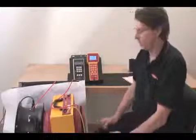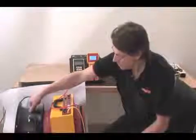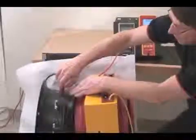Okay, this is about tubing fittings. We have three different kinds of fittings here. This style of fitting has a little ridge, one ridge around it, and when the tube gets pushed over, the seal actually happens right on the ridge.